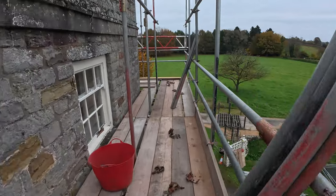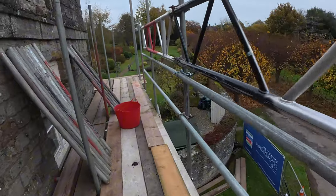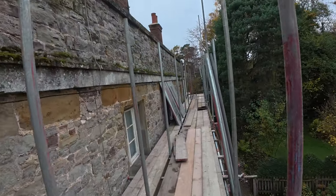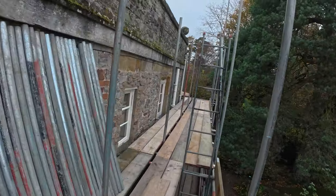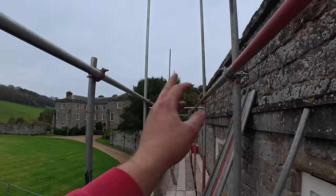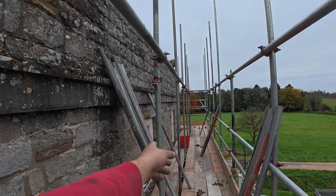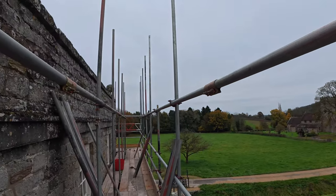Get all the kit off ready to make a start — so all the fives, all the boards are on. Just got to run this lift through and run the back through. So we've run most of the lift through. I've just gone along and done all the doubles up on the fronts. What I'm going to do now is come along, put all the fives up on the top so they're ready to go, and then I can start getting my braces in and tranny it all — everything's there ready.